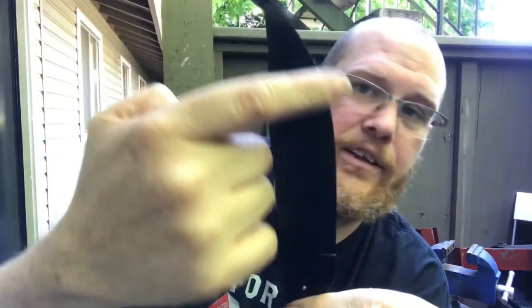I'm stoked. I think this thing's going to look awesome. So I'm going to tell you what I'm going to do right now. We're going to pin and epoxy the handle. Then once that's done, we're going to start shaping the handle, getting it all thinned out and comfortable for the grip. And then we're going to make the back and then the edge. We're going to make that nice and shiny silver. That's why we did that up to 1,000 grit on the bevels. Above the bevel, we're going to leave black. And I'm going to torch and linseed oil the handle.